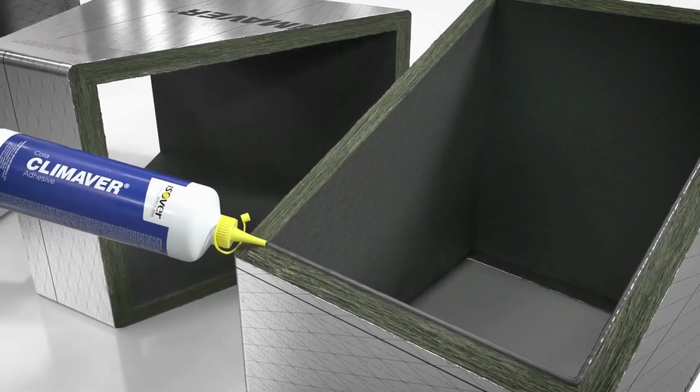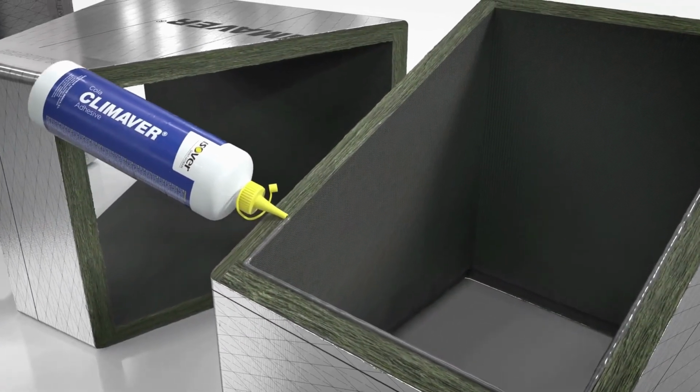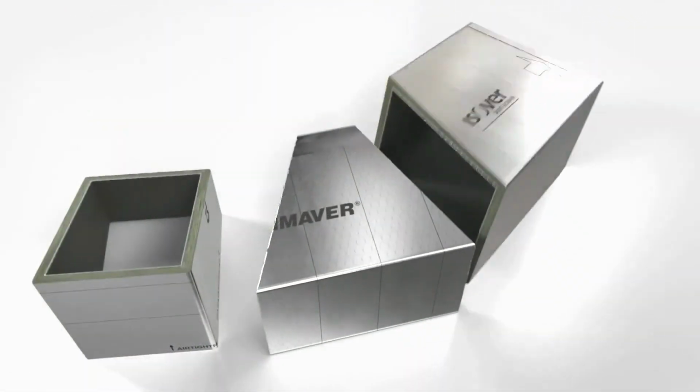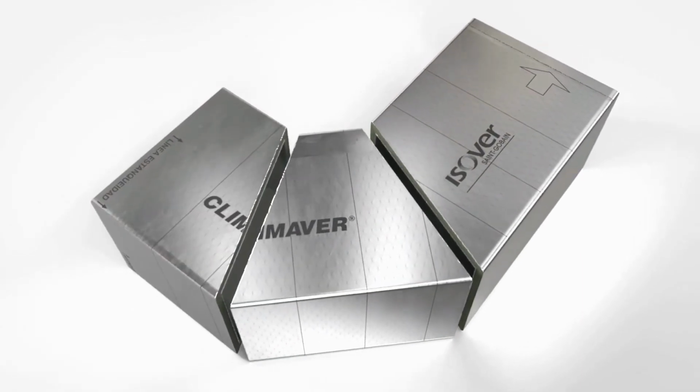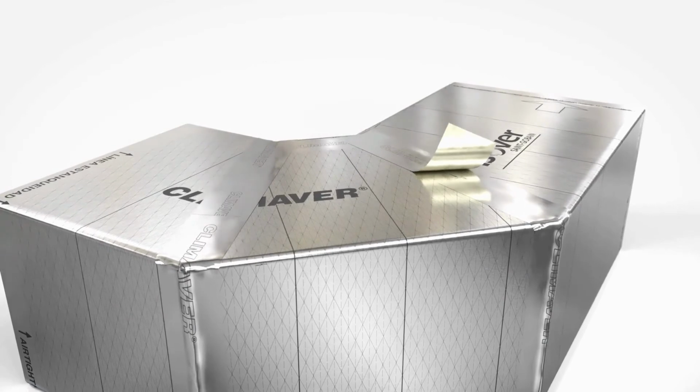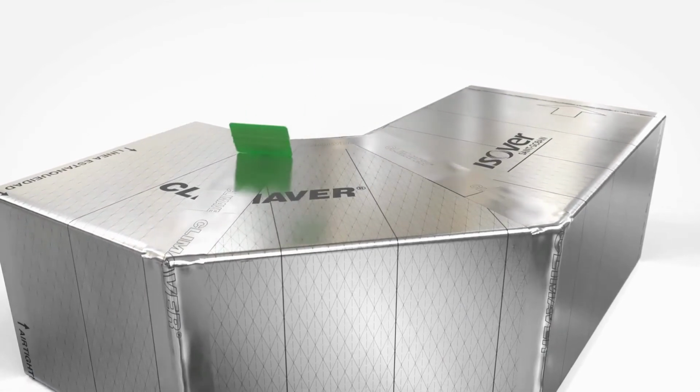A continuous bead of Climaver glue is applied to the inside of one cut edge. The duct segments can then be joined together. Afterwards, all cut edges are again covered with Climaver aluminum tape and pressed on with the Climaver spatula.